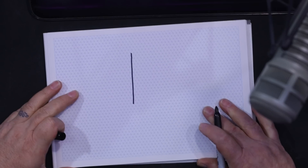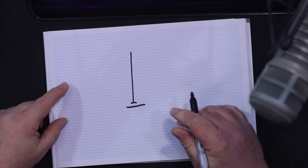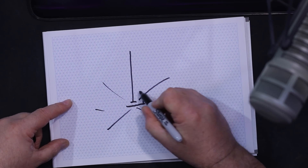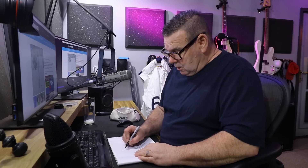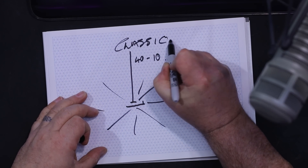I want to cover the basics of the DX Commander technology — the multiband vertical design. It starts with what we call a 10 meter pole, actually between about 9.2 and 9.7 meters depending on which pole you buy. We have the driven plate, the ground underneath where the SO-239 fits, and you put some radials down. This isn't a radials tutorial — if you just put down the wire we supply in any shape, direction, or length, it'll just work. The original design covers 40 through to 10 meters — that's the classic.